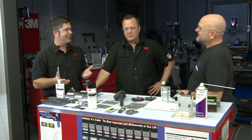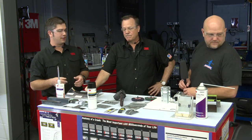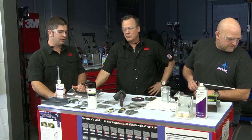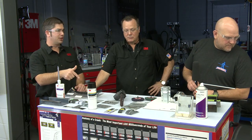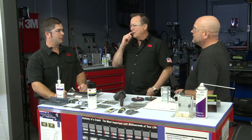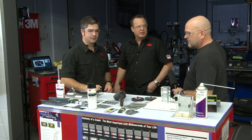But we can't do that, right? So we need to have some solvents in a can to deliver them to those flange areas to protect these metals. And then it's important to point out, like Sean said, removing it so we get good weld fusion when we're actually going to make the MIG welds. Let me pull up some pictures of that, Ryan, while you're maybe taking the next question.